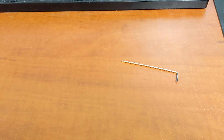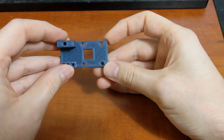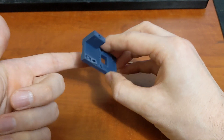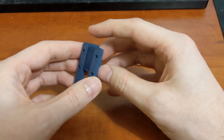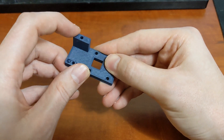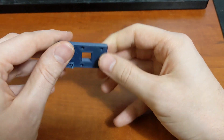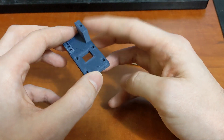Let's pull off this print from the bed. I accidentally broke it but I'll show it off anyway. This is just a mechanical part — I should definitely be more careful when taking it off the bed. So again, this is my new part: the belts are going to sandwich between this and the linear rail, no more zip ties. I've already increased the height of this by five millimeters. Really nice — everything is nice and sharp, corners are super sharp, holes look excellent. So there are some examples of print quality and I'll show you a print demonstration of this part being printed.